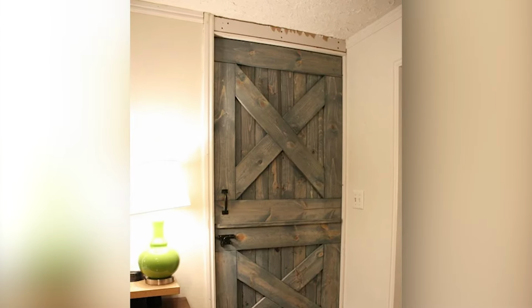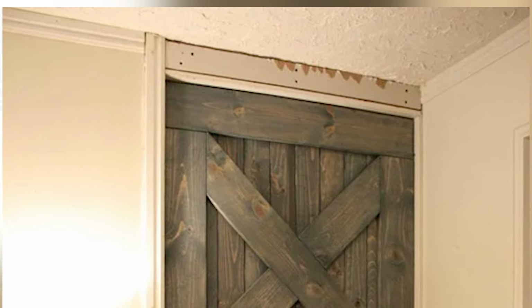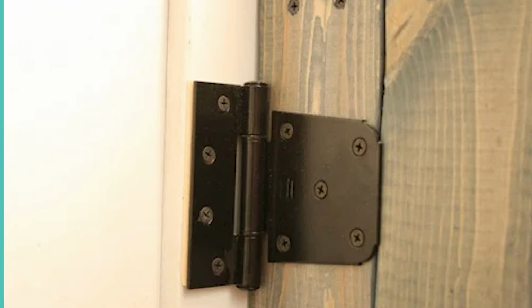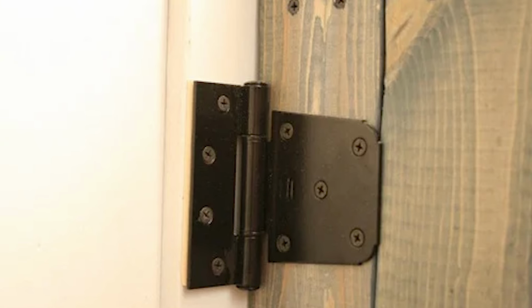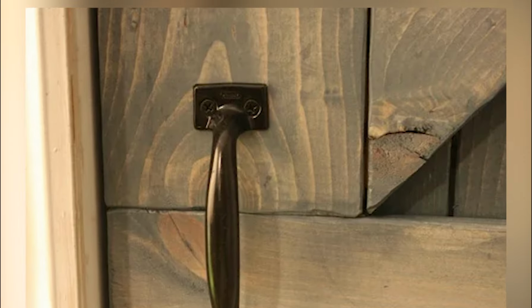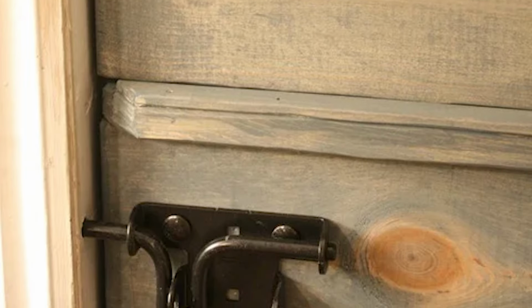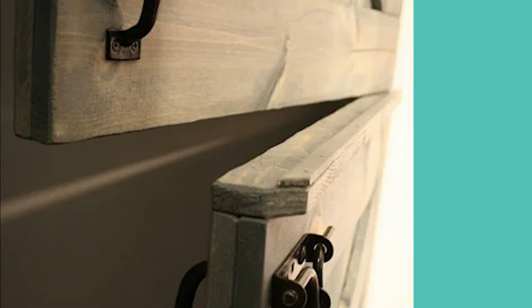Repeat the process for a second door section to create the top of the Dutch door. Measure and adjust to the height needed for a perfect fit. Now, just add the hardware. We used heavy-duty gate hinges attached directly to the door jamb, plus a gate latch to hold the gate shut. Handles make it easy to open and close, and a ball door catch attaches the two door sections together so they can swing like one full door.